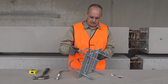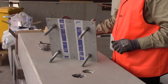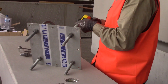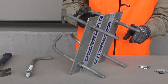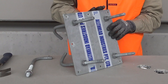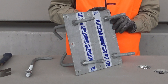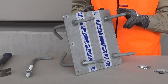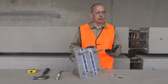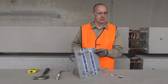One of the first considerations when specifying the product is the specified size. In this case we've got an L-bolt which is 300mm long and M16 in size. Other considerations when placing an order for L-bolts or J-bolts will be around the finish required — whether it's a zinc-plated finish for internal use, or a galvanised or stainless type product, or other exotic material — all should be specified directly with the supplier.